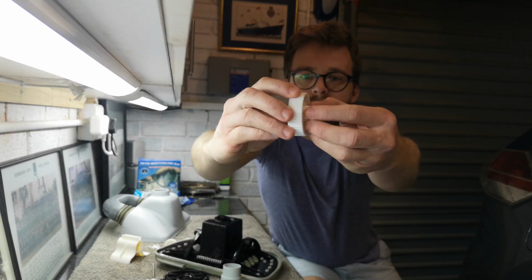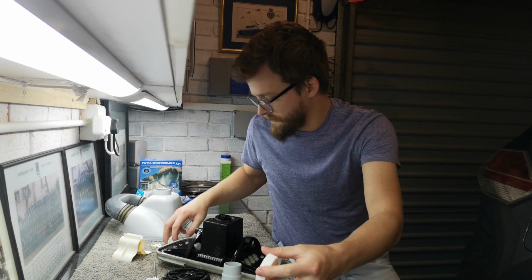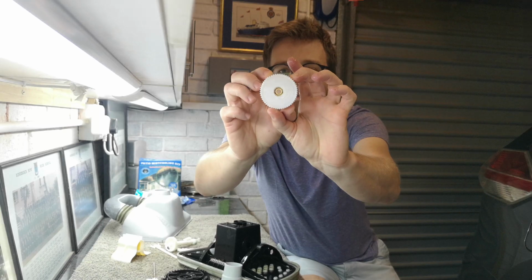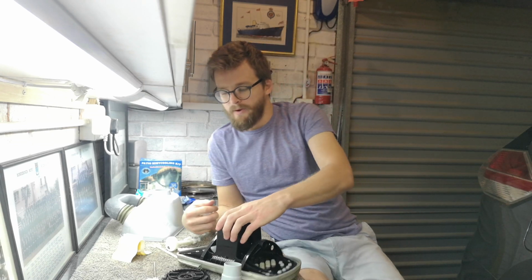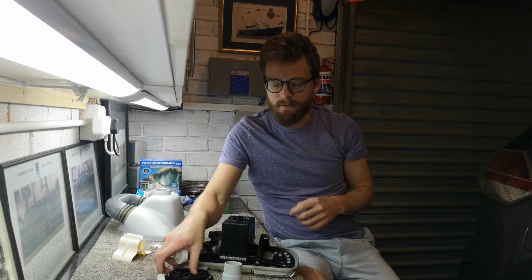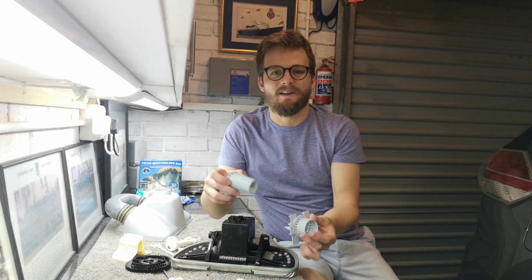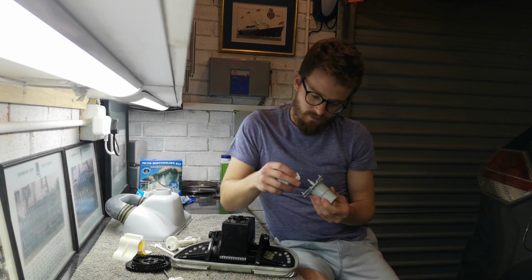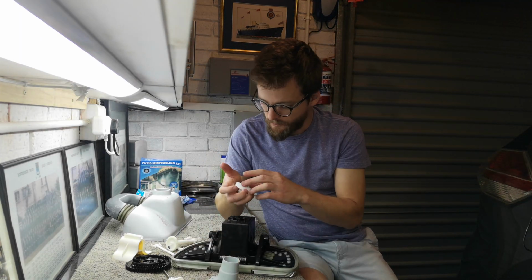This is the clutch. It's pretty simple. It's just got a little gearbox inside there. As this thing turns around, this is what ratchets up the creepy. And by ratcheting the creepy, it moves the big planetary gear. The big planetary gear moves the part on the top, and that makes it turn on its hose. And by doing that, it randomly travels around the pool, which is all good and well when it works.